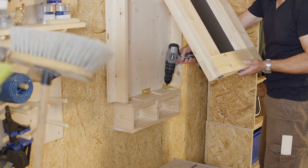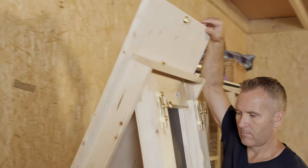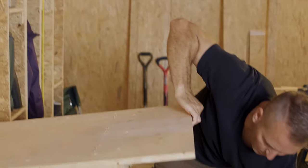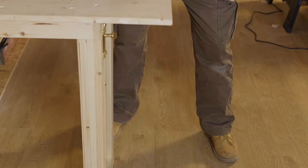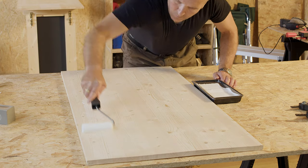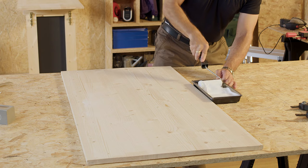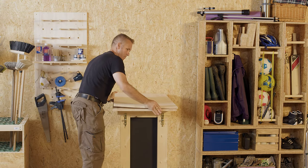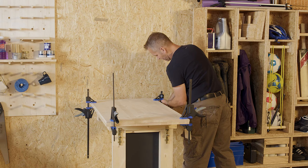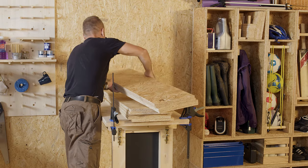Carefully lift the drop-down leg, drill pilot holes, and secure the other half of the bracket with screws. Gently lower the table into position and lock the leg using the deadbolts. Apply a generous coat of PVA glue to one side of the second table top sheet and the upper side of the table top that's already installed. Stick it to your table top, making sure both sheets are aligned before clamping them into place. Apply as much pressure as possible and let the glue dry.